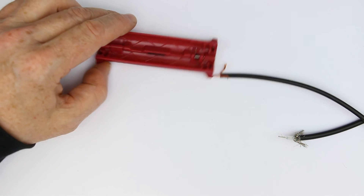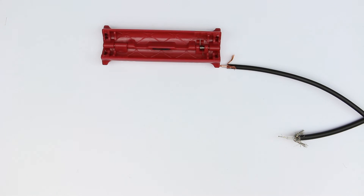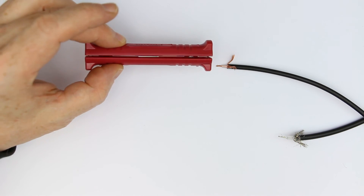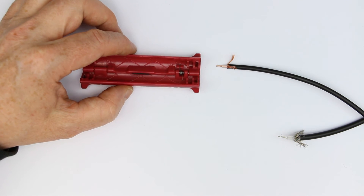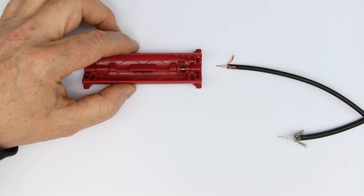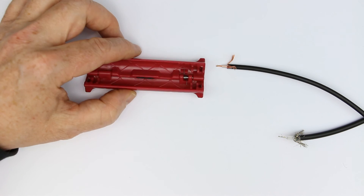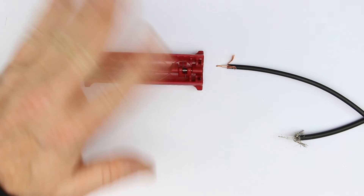This little tool is quite cheap. If you are in the situation of assembling your own BNC cable — for example when assembling your own satellite receiver system cabling — this comes quite handy. One or two times practice and you will get perfect stripping of coax cables. That was it for today. I hope you liked it, and if you have any comments please leave them in the YouTube comments or in the forum. Until next time, bye from Kankalabs.